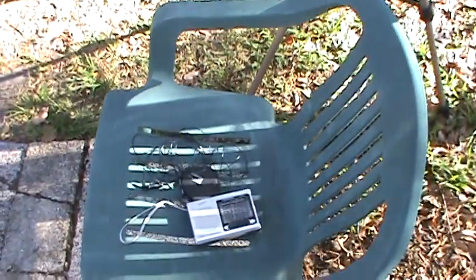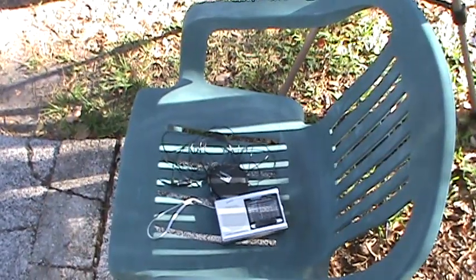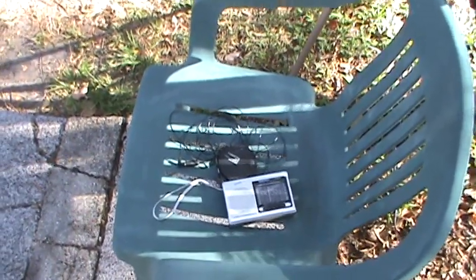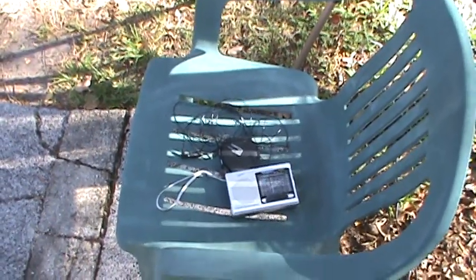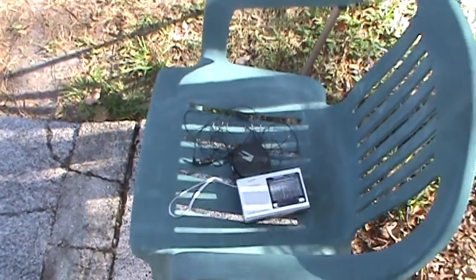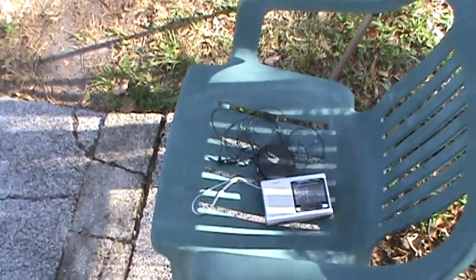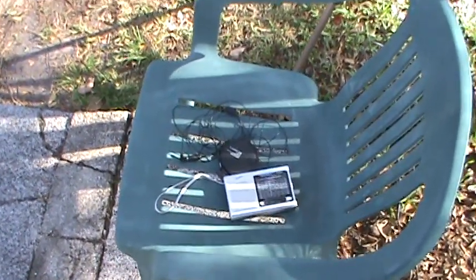Just string it up like I did. You can either do it temporarily like I did or permanently. But if you use it outside away from your house and all the RF noise, you're okay. But if you want to bring it inside, you need to attach a piece of shielded coax cable to that antenna wire, away from the house and away from the RF noise, and then use that shielded cable to bring the signal into your house. Ground the shielded cable and then use the center conductor to connect your radio, so you can have a permanent setup.